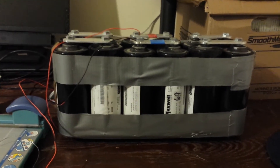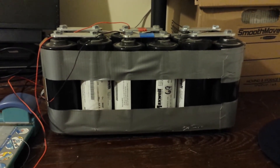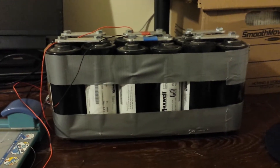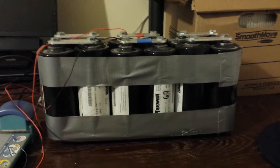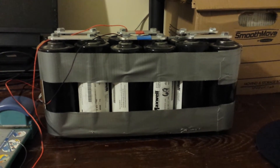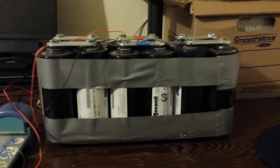I'm again wired up for 48 volts, so I'm not going to risk that. But one quick thing that I plan to do as a test is I have a 36-volt battery bank hooked up currently at a grid-tie inverter — it's a modified inverter with feedback to the grid — and what I plan to do is actually use this as the positive point for my 36-volt bank, wire them up in series, so I'll get 48 volts. And just the same that I had this as a buffer for my 12-volt bank, I plan to use this as a buffer for my inverter for the 48-volt bank.